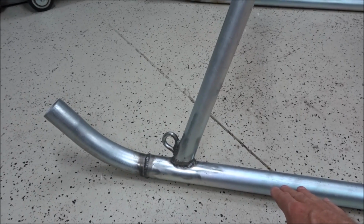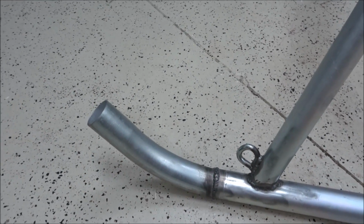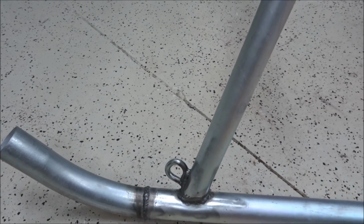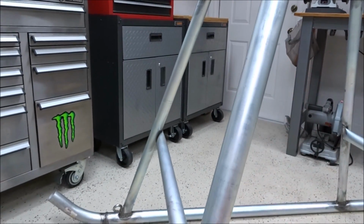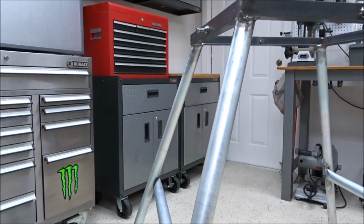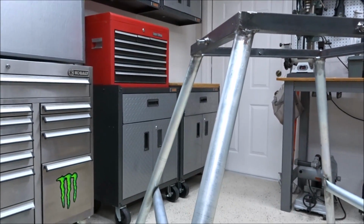This bottom 2-inch piece of EMT is 5 foot long on both sides, with about 1 foot of elbow added to it that we welded to it. So these are nice and give us some surface area on the ground. These corner posts that you see, these are all cut at 42 inches, and that gives us a perfect height with the barrel to still be able to reach up and pour a bag of corn in the top of this feeder without it being too tall.